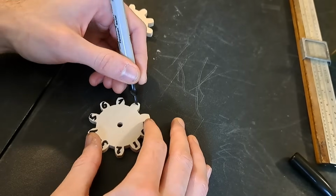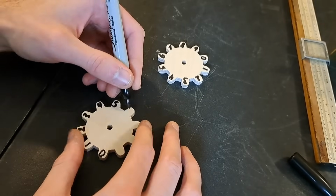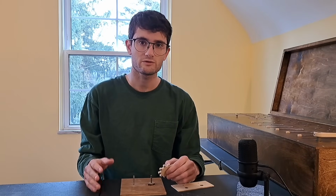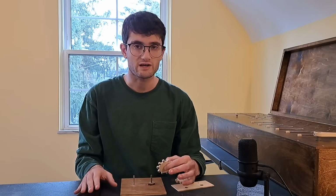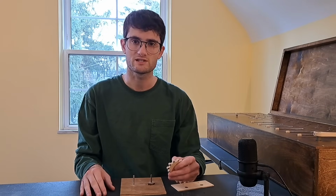If we were trying to use Roman numerals, we couldn't get away with just having 10 teeth, or using the same design of wheel to represent tens as that which represents ones. Before making this calculator, I had never really thought about how the position of a number encodes part of its value, and how this is very advantageous for mechanizing arithmetic. It means we only really need to deal with adding up to 9.